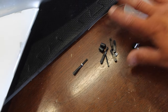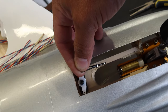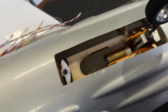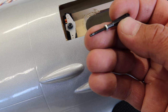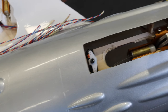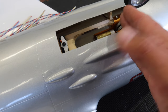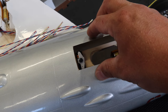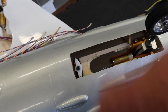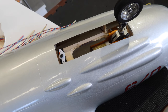Got our pull-pull setup hardware all out. I like to have some adjustments on these setups because once they start to stretch over time, if you don't have adjustments your steering is going to be loose. You set these up with a clevis and the threaded piece so you can tighten that down as things stretch. You can take a thick zip tie, loop it around, and use some shrink tubing to hold it onto the cables. When this gear retracts, the zip tie's natural tendency is to spread out, spreading those wires away from the gear, and when it retracts it cinches back to that U-shape.